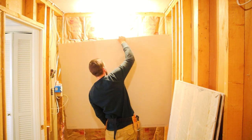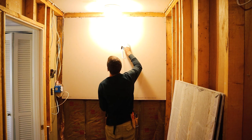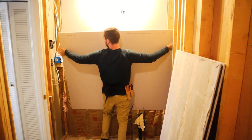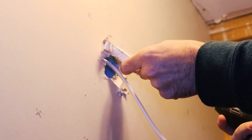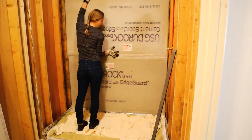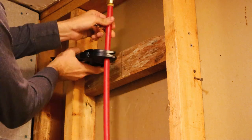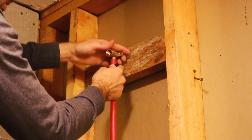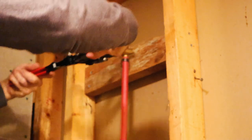And this is where the bathroom really starts to see the transformation. We took it down to the studs and opened the floors, and now we're putting it all back together. My wife came up to keep an eye on me and we knocked out quite a few things together — I work better under supervision. I screwed in all of the ceilings and walls we did not take down. Working with PEX ended up being one of my favorite lessons learned through this flip — it's quite simple and easy to work with. Fastening PEX to brass fittings is as easy as putting a brass ring there and just crimping or compression fitting it together.